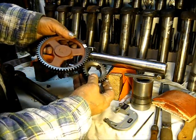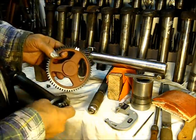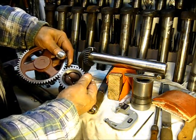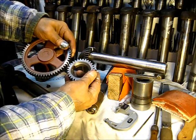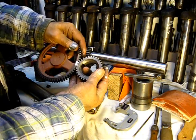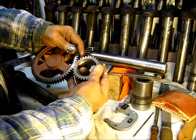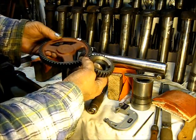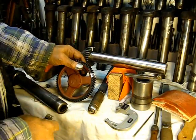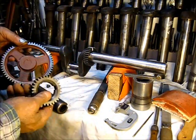When we put it all together, looking through the side of the engine, we place that one tooth in between the other two. All three teeth will have a mark on them when it's timed as it left the factory. Make a complete revolution and that tooth will always come back. Any time you see those three teeth lined up, it's in alignment — you can't get it a half turn out. It's one of those things you cannot get wrong.